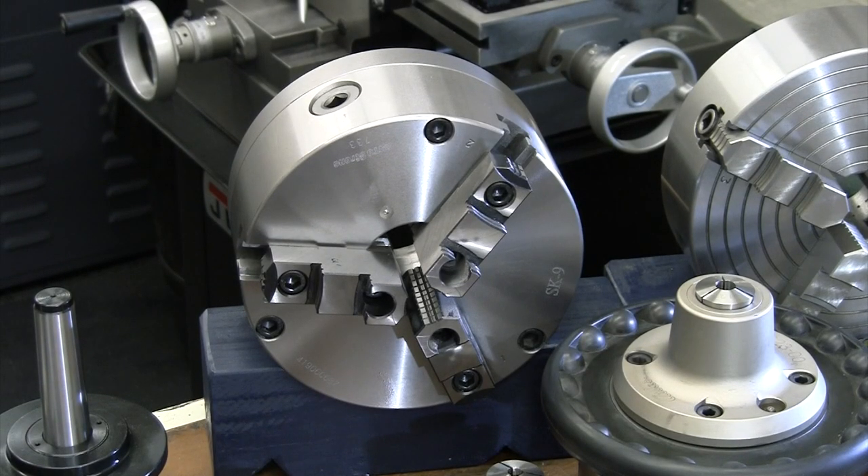Starting at the headstock — the three-jaw chuck comes standard on pretty much any lathe and is your go-to workhorse. I worked full-time as a machinist for years and spent a lot of time with a three-jaw chuck. When people talk about the accuracy of a three-jaw, they mean repeatability: once you put a piece in and turn it round, it's as round as your spindle bearings can turn. The inaccuracy only comes into play when you remove the piece and try to put it back in — there's a low probability it will run perfectly concentric to where it was.